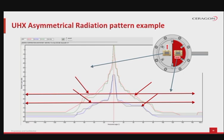For example, imagine a second antenna installed at 90 degrees orientation to the right side from the current antenna, with its asymmetrical pattern oriented left. Even in a rough comparison, you can see a difference of radiation or energy concentration on the two principal side lobes. The left and the right one show a difference between values of 3 decibels or more, which is twice the power or even more. Such an arrangement would decrease the interference to an antenna placed somewhere close to the end of our current link, to the right side of the far end antenna.